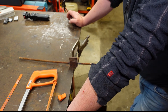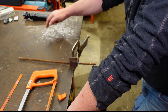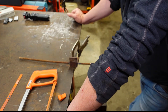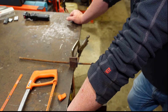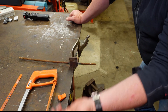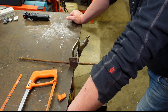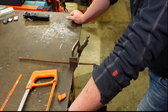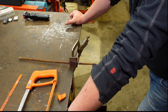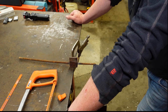Now the object of this video isn't to tell you that you need to rush out and buy a plasma cutter, but what I want to do is just go through each option and maybe outline the benefits or the pros and cons of each option and maybe some price indications, and just give you an awareness of what's out there. So if you are trying to make up benches or shelving and you're hand cutting the tubing or the square profile with a handheld grinder, you'll find that it's a bit wonky afterwards and not quite as precise as you'd like. You can see why that will be and why you'd gravitate to a chop saw or something where you can get a more precise or more consistent cut.